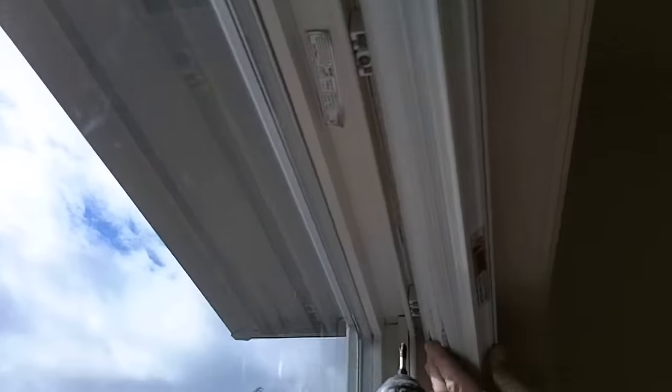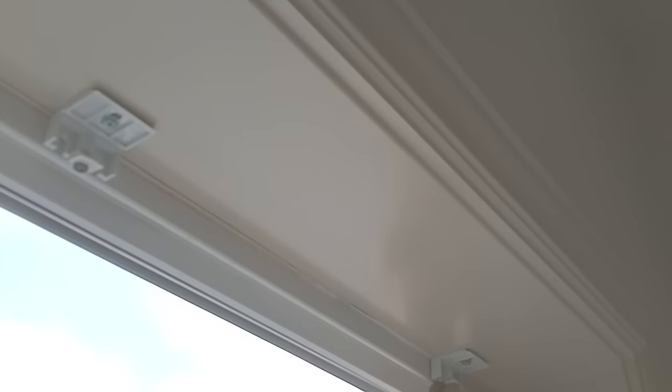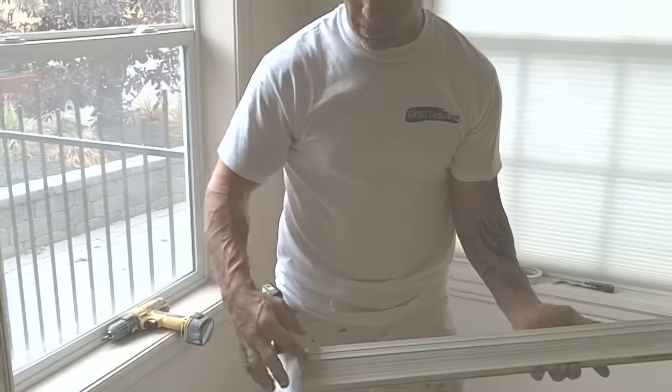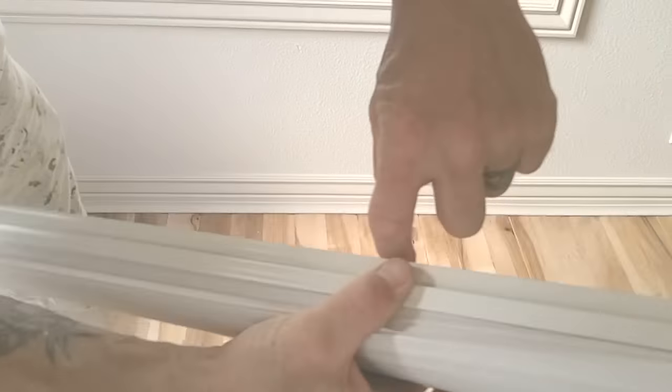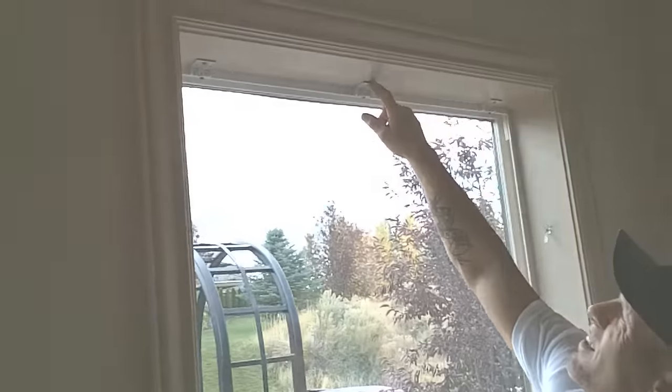You want to just loosen them halfway — don't take the screw all the way out, because there's a little plastic piece that will fall out and you'll have to put it back in. So just press and hold the blind in. This tab has got to be facing outward. When you go to reinstall that blind, it's going to catch on the top part. We're going to screw and tighten these little tabs. You know the face of the blind because the strings come out there, and there's a little ridge right inside that's going to catch on right here.